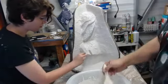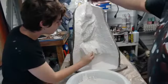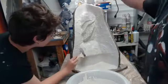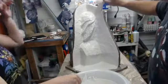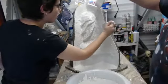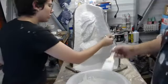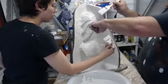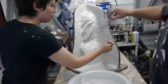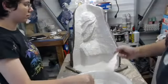For the burlap layer, do you want to go to a double or a 1.5 batch? Yeah, I think if we did a 1.5, we're going to probably have one more coat of thinner stuff, and then we're going to move on because we barely have even a 1/8 inch. So we got to build this up a little bit more before we start throwing some burlap, and we need to eliminate some of these undercuts under here. Okay. So once this gets creamier, we'll be able to pack it in there now that we got a couple of eighth of an inch thickness there.